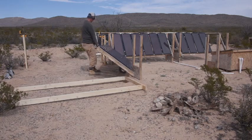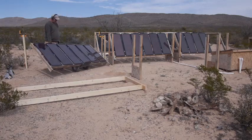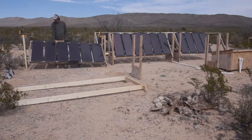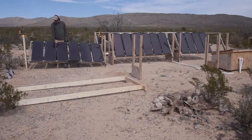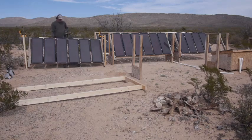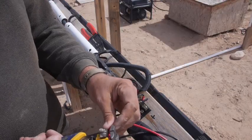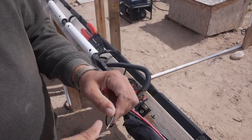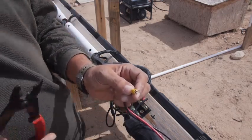I made that so that I would get the new set of legs put in the right position. I was very careful about making a nice template to use. Well, I forgot there's two lengths of common 2x4s. There's some that are 8 feet long, and there's some that are 92 and 5/8 inches long. The idea is you take the 92 inch ones and you put a top plate and a bottom plate on that, and that equals 8 feet. I got that wrong. So when I did that, I was a few inches too far. Yeah, that sucked.